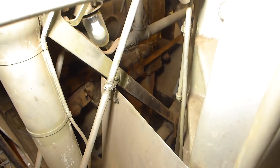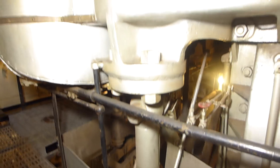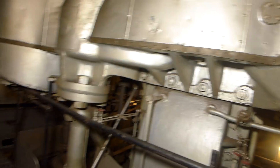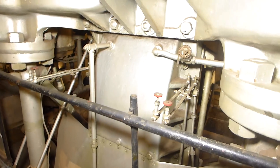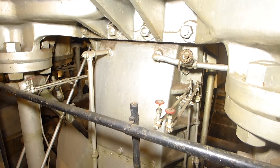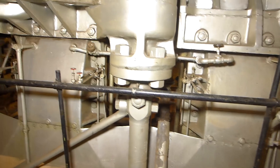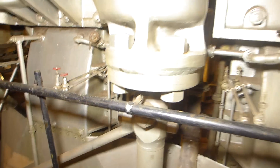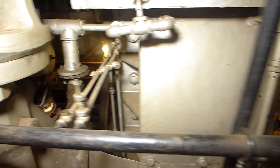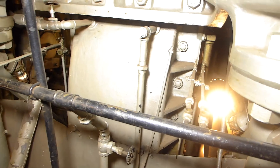As you can see, they're also cross-braced. You had one of these structures here and here, directly adjacent to the low-pressure cylinder. What we're looking at here — this kind of odd casting — is called a crosshead guide, and we'll talk about that in more detail. While it wasn't light, it was certainly lighter weight than the old design, and it's extremely rigid. One other thing is this black pipe that runs here. You can see there's a series of little valves on it that are spaced. This was a lube feed oil line that went to the crossheads and was extremely critical.